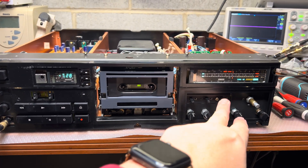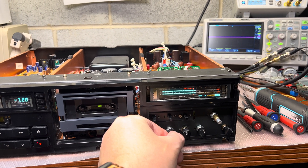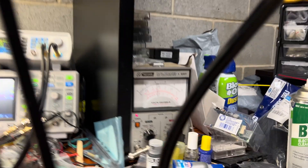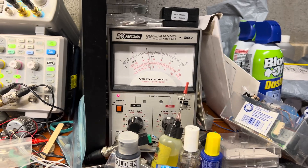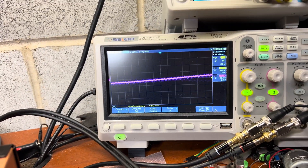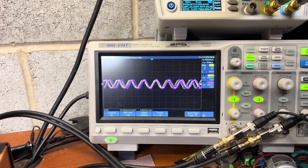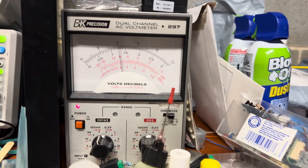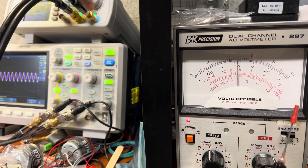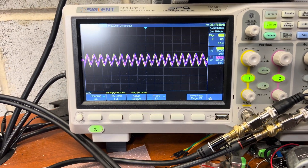Let me show you the results. This is a metal tape, Sony calibrated. I record at minus 20 decibel. At 400 Hz source tape — good. Now 10 kHz, 400 Hz — no difference. Same amplitude size. Then 11, 12, 13, 14, 15, 16, 17 — and it keeps going: 18, 19, 20, 21, 22, 23, 24, 25 kHz — starts to drop minus one decibel. At 26 kHz, minus three decibels, and it's still recording. Imagine how cool that is.